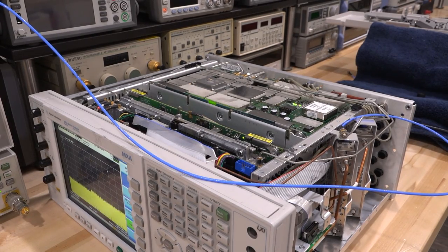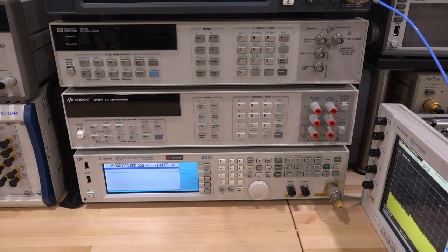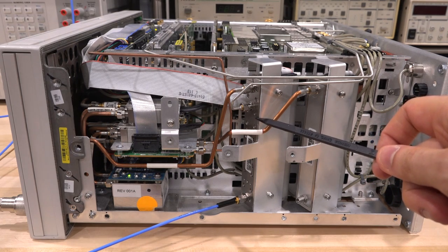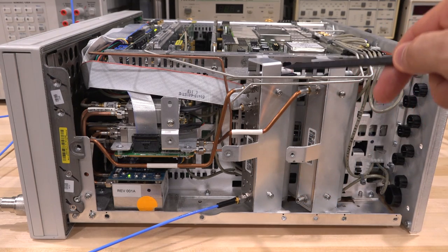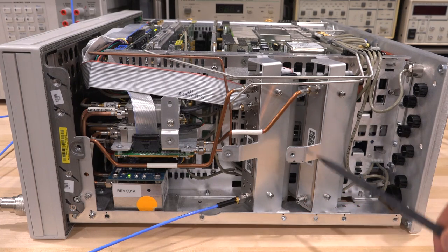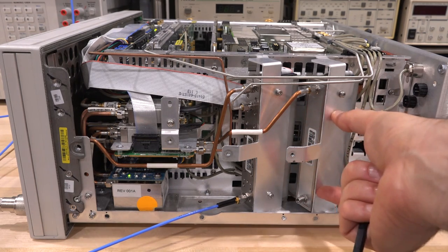Which means it's very likely that the issue is not the calibration signal, as I anticipated — it's probably the attenuators. So let's rewire and use our synthesizer to inject the signal into the various stages of the attenuation chain, see which of them is faulty, and then take the next step. Now we're wired in for only the front-end attenuator and calibrator switch. The calibration signal is back into the attenuator, the front input is going to the switch attenuator as well, and I'm taking the output of that directly to the spectrum analyzer, completely bypassing the 70 dB variable attenuator that comes after it.